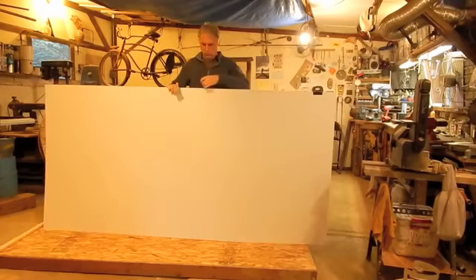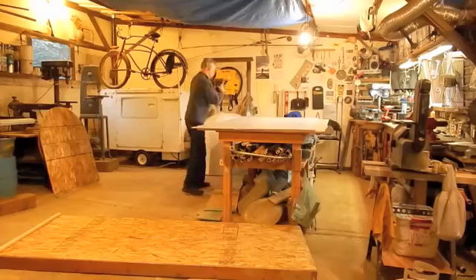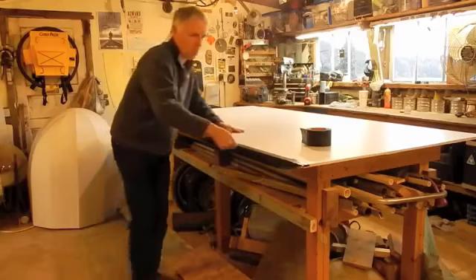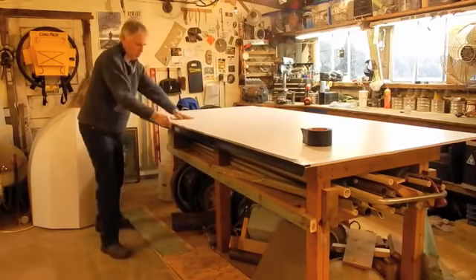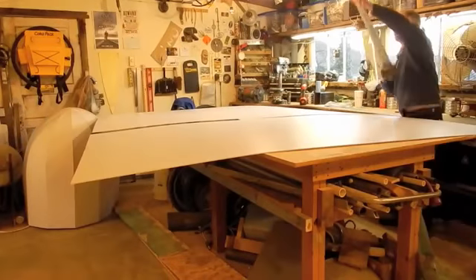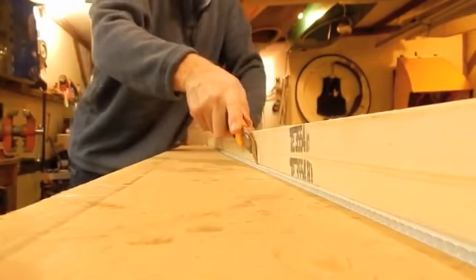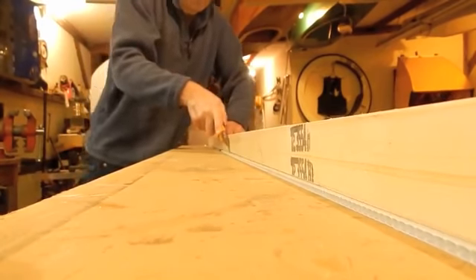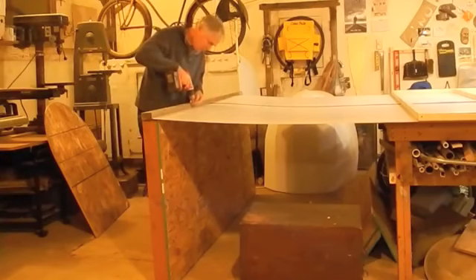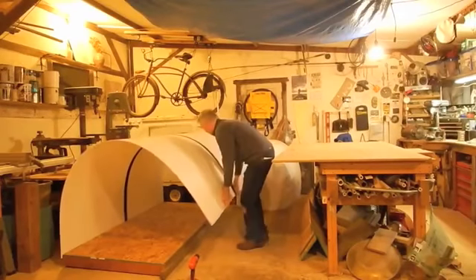Unlike the previous shelter that had two pallets where I assembled each sheet over one pallet and then joined the two together, here I'm taping the two panels together. This is the taping technique I use when I want two sheets to fold together. Coroplast always comes in different lengths, so here I'm trimming them down to get them the same length. I secured a 2x3 to the bottom of the base as a stop guide for the Coroplast sheets, and then later I removed them.